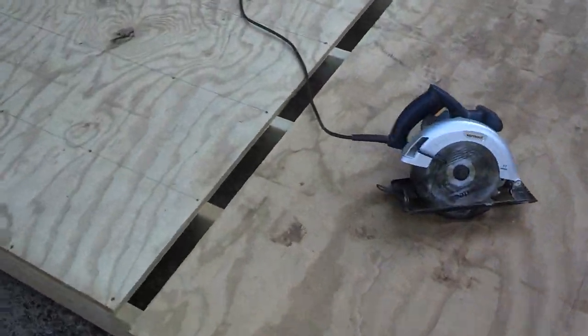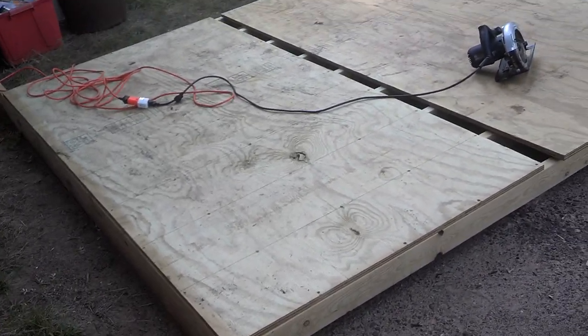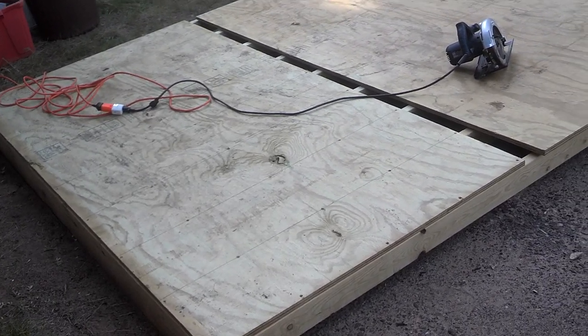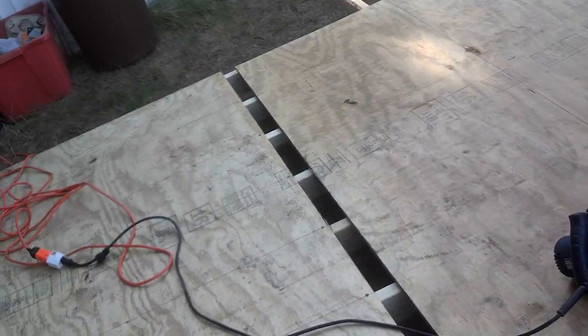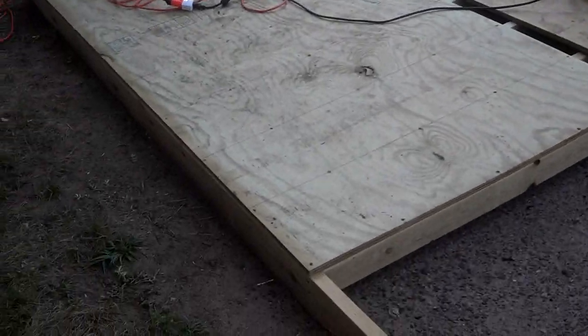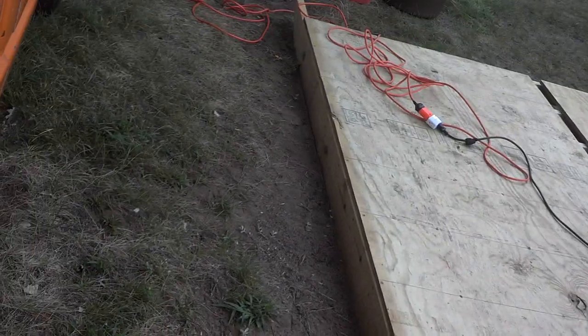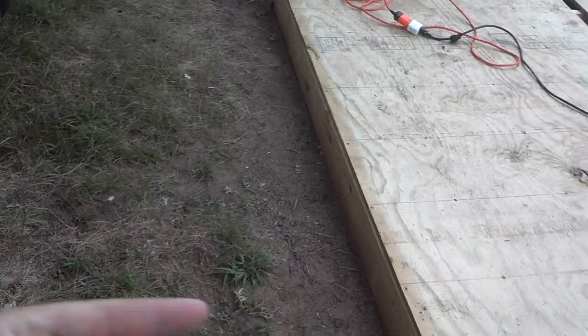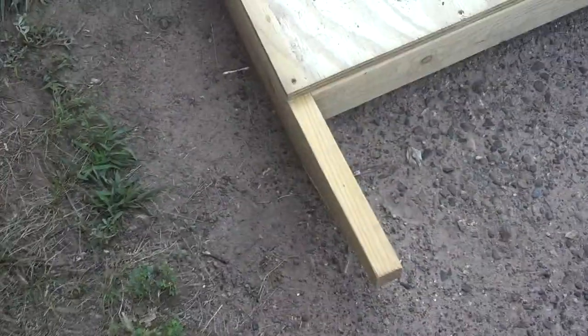Right now I'm about to back up a bit. I've got one two-thirds of the decking screwed on. I have one-foot centers using two by fours, as you can see there. I'm going to cut the other piece of 4x8 sheeting — I used two by sixes for the sides and screwed into the two by fours from the outer edge of the two by six.